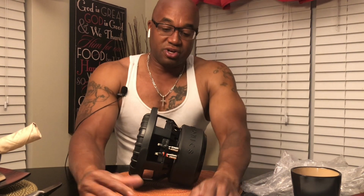They do want you to tune this thing relatively high, which we're not going to do at all. For SPL, they want you to tune to 44, which is, you know, in the 40s, where people pretty much meet the highest. For the musical box, they say tune to 39. Well, you know me, we're going to tune it. My favorite number is 33. Yeah, 33 hertz. That's what we're going to tune it at. And it's going to perform with the instructions I have for it.